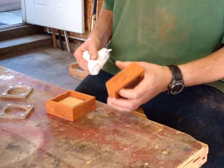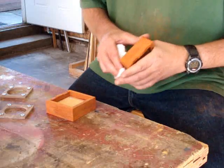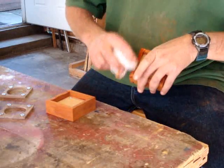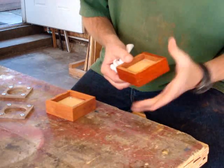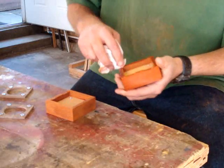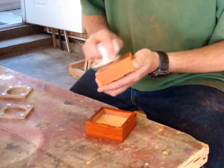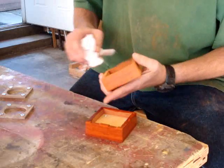A tip when using an oil finish: once you've sanded down to 240 grit, take a wet rag — just water — and wet all the surfaces. What this will do is raise the grain. The little fibers in the wood will raise up — you really can't see them, it's almost microscopic — but once this water has dried, go back and sand it again with 240 grit sandpaper and you'll be left with a really nice smooth finish.